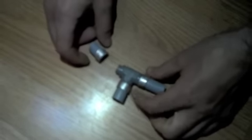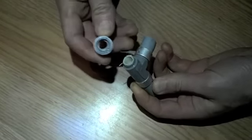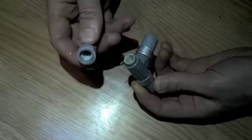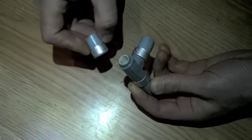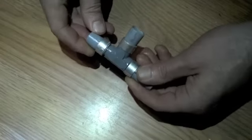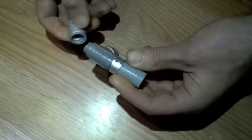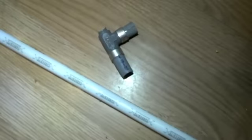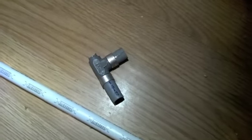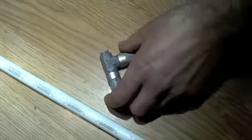Okay, so here's the old polybutylene fitting that we cut out. You can see it's cracked, just sheared right off, right at the crimp ring, which is why they don't put these in houses anymore. They just break the plastic fitting. So we're going to replace that with a brass fitting and use this PEX pipe, which is a slightly different diameter, but does the trick.